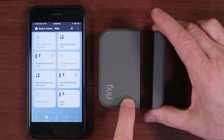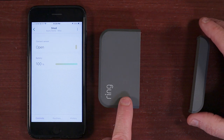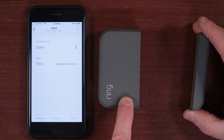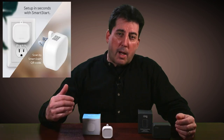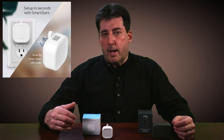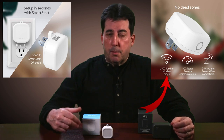So what are the key takeaways from this venture? The Ring Alarm Outdoor Sensor can be paired with the SmartThings Hub. However, to be fully compatible with SmartThings, the sensor's device handler must be changed in your SmartThings account to a Z-Wave Plus window door sensor. The operational distance of the Contact Sensor can be enhanced by the use of the Aotec Range Extender. In my particular situation, I was able to extend my operational range by 250%, which confirms the performance specifications reported by Aotec.